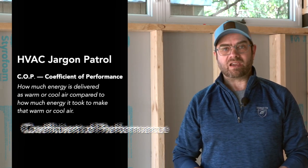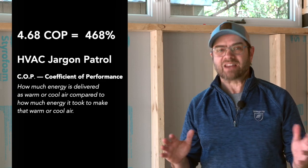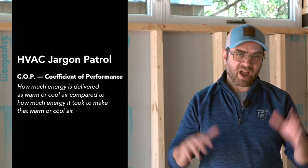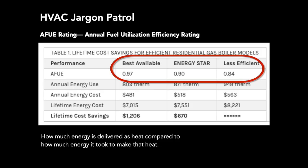And when it's not freezing cold out, it boasts a pretty impressive efficiency of 4.68 COP, which is like saying 468% efficient. And when it does get down to 0, or minus 5, or minus 20, that might drop down to say 1.6 or 1, which is like saying 100%, or even maybe as low as 70%. But you compare that against a traditional furnace or boiler running at 96 or 97% efficiency at its peak performance, and that's still a pretty good deal.